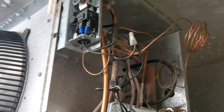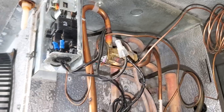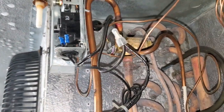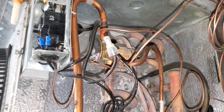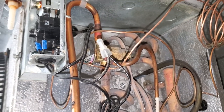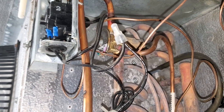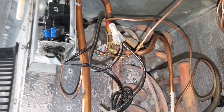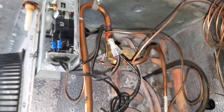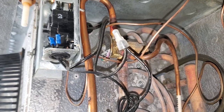That'll be my solution so long as I see it come down to temperature. I'm going to watch this and adjust the temp control to make sure it's set correctly. I don't like these Emerson Alco valves — I just have problems with them, maybe it's just because I don't understand them. I'm not saying the issue here is completely that valve, but I don't like the fact that you can't change the powerheads on those. I think there was some moisture or something frozen inside the valve, some wax buildup or contaminant. If this was a Sporlan valve, I'd probably just take it apart, inspect it, replace internal components.